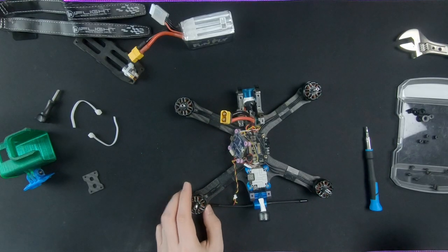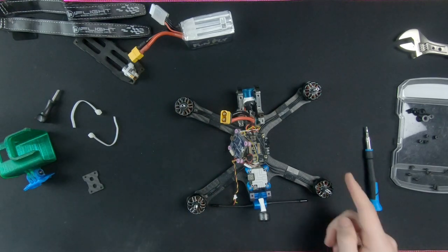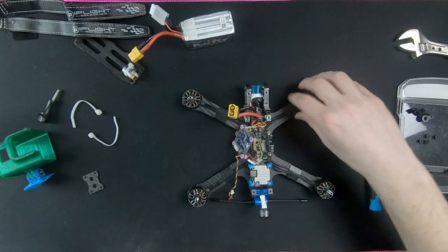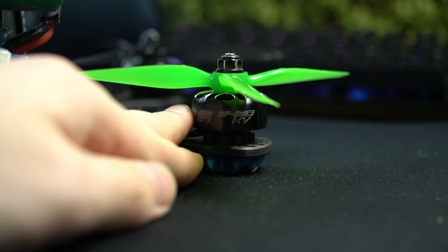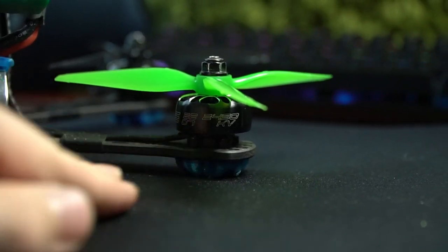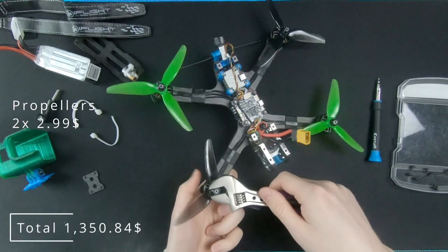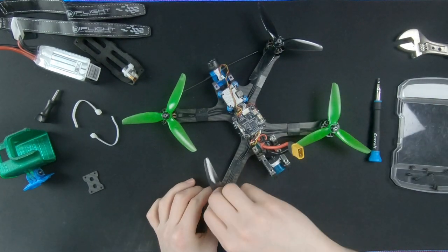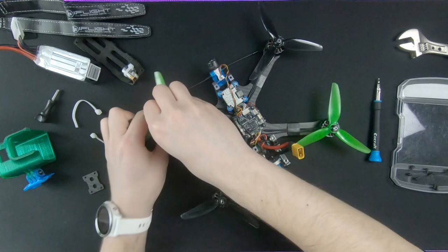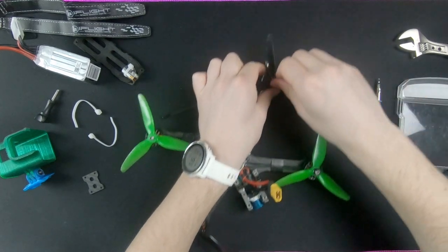Back to the drone. We have 4 motors, but you can find FPV drones with 3, 6, 8 or even more. Remember, you need to decide if you are doing a 4S or a 6S build — you need to choose your motors' KV rating based on that. These motors are 2450 KV and are perfect for a 4S build. Then we have a set of props. You will probably need to buy at least 2 or 3 more sets if you are going to crash or chop them up, but they are really durable — though that depends on the brand.